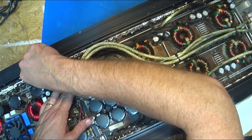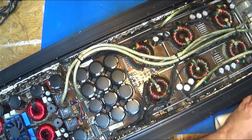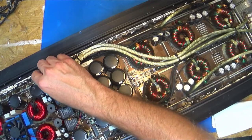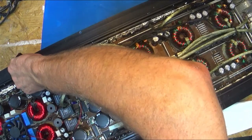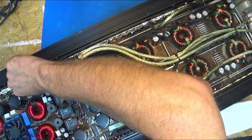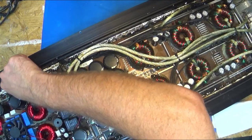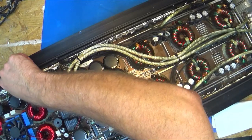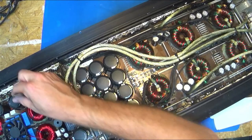And everybody tells you, don't mount your amps to the speaker box. Well, that's true. Don't mount cheap amps, especially ones that don't have proper support, to a flimsy subwoofer box, because you will get vibration damage. I've got on my channel a little Kenwood that was vibration damaged all to heck, and that's all it took to fix it. It hadn't blown, the circuitry that came apart just stopped it from working.